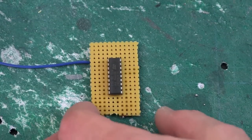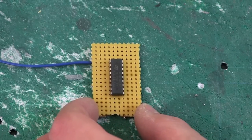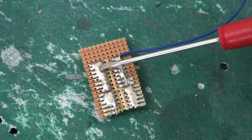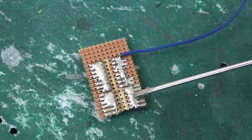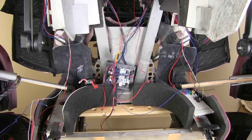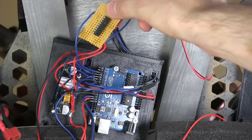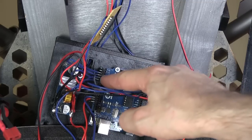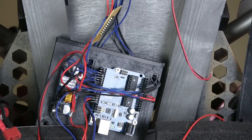I've mounted my ULN2803 on a piece of strip board. The blue wire is the signal in from the Arduino that's going to power up those servos — I'll do a high on that pin just before I run the servo sequence. On the back there are lots of solder joints — I've bonded all the inputs together, all the outputs together, which will go off to the actual power for the servos. These pads here take power into the chip — that will be the existing positive and negative from the voltage regulator. So we're back in the back of the suit and we've got that board just there — it's spliced into the power that goes off to all the servos in the shoulders, both those for raising the shoulders and turning the guns. It's wired into pin 2 of the Arduino to trigger it, so now nothing happens until pin 2 goes high — that turns on the power to all those servos and also the NeoPixels. I just need to recode the Arduino so it brings pin 2 high before it runs the servo firing sequence and brings it low again afterwards.